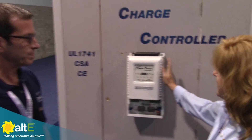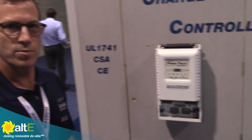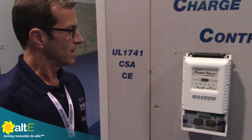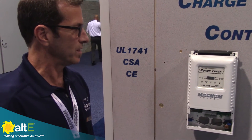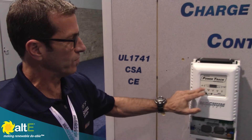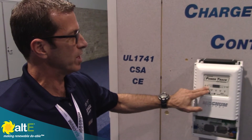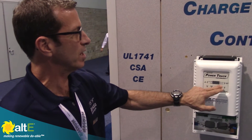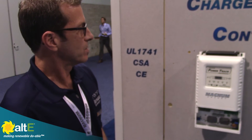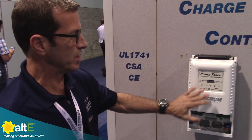It works with all the panels and mini panels. It has a 200-volt open circuit, operating at 187 volts continuously. It gives you a full display here that scrolls, showing you the PV array volts and kilowatt production. On the battery side, it shows the voltage and amps going in — so it provides a lot of functionality just as it is.